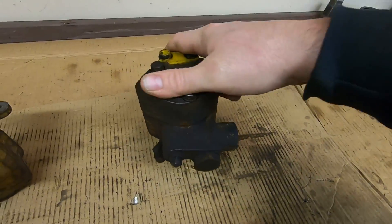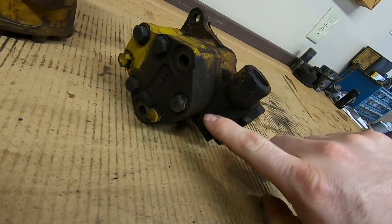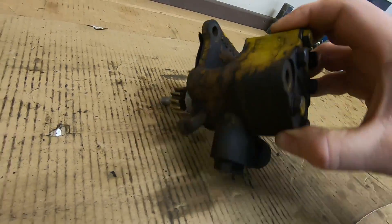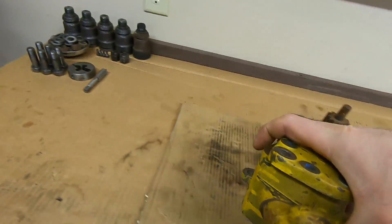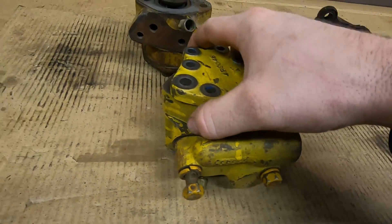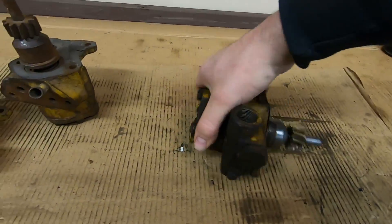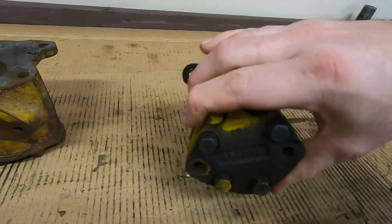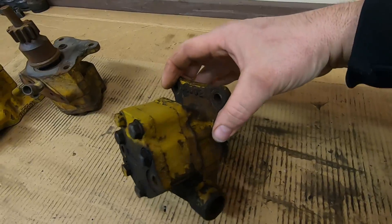Another thing I noticed down on the bottom is that it's all one piece — all intricately cast into the main housing. Again, what I'm used to seeing is more like this other unit where that whole bottom part is separate and just bolted on. There's a little pressure relief down in there, and I'm assuming that's what's behind this big plug — a different style pressure relief. But other than that, it's just a gear pump with a set of gears and a pressure relief valve.